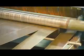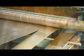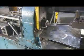The factory makes both these tubes from a steel sheet sliced into strips. Inside this tube mill, coolant prevents the passing strip from overheating as one forming roller after another gradually rounds it into a tube. Then a copper welding wheel fuses the tube closed. As the 5.5 meter long tube comes off the mill, a cutting tool chops it into shock absorber lengths.